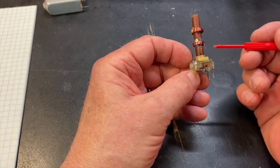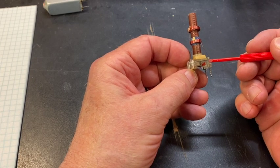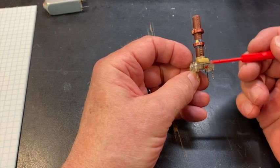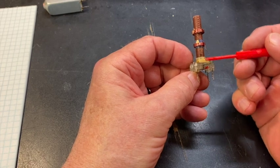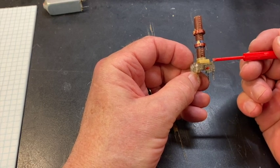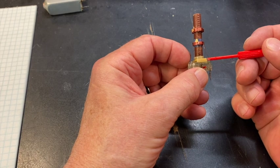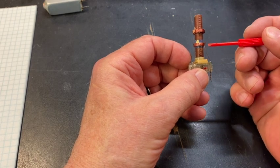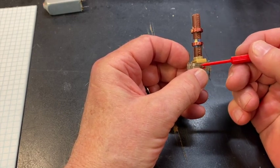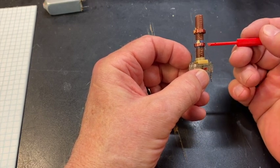A coil, an inductor, and a capacitor in parallel will create a tank circuit, a resonant circuit. What that means is that these two want to vibrate together. They want to be in resonance together, and they will oscillate back and forth at a certain frequency range. If you want to change the resonant frequency of a tank circuit like this, you can either change the capacitance of the capacitor that's in the base, or you can change the inductance